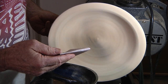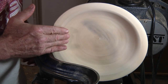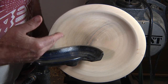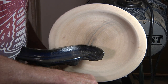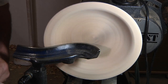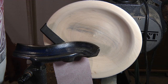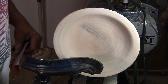This is for sanding. If you've ever done any hand sanding, you're all familiar with this move — the paper goes flying off, so the next time you try it you're holding it twice as hard, and it'll grab and pull your hand down. If you have a tool rest in here while you're trying to sand, just like sticking your hand in while it's spinning to feel it, you run a huge risk of getting your fingers pinched in there. This is your finger with a little sandpaper around it — need I say more?